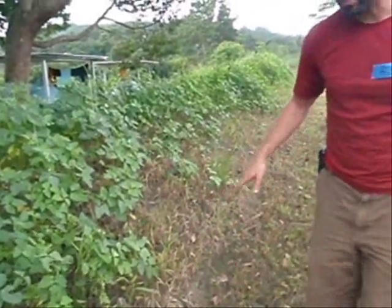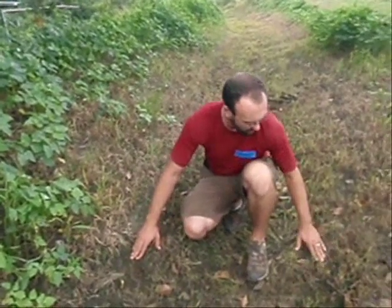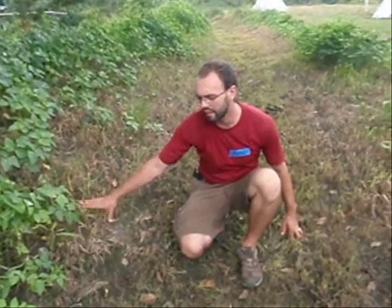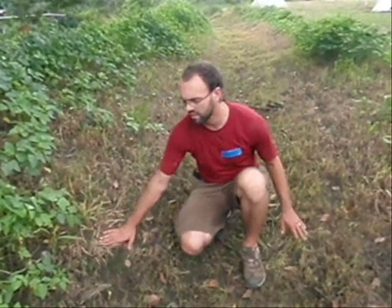Because it's a swale, we're fixing the water cycle. This swale has spilled a few times since we put it in and you can see that we're still really moist here. When I walk around I can feel the moisture. This swale continues on the property for about 500 meters — half a kilometer — and when it rains, this whole swale will fill. Because this is a soft mound on the downside of the swale, it's going to infiltrate thousands and thousands of liters into the ground, recharging the aquifers and fixing the water cycle on the site.